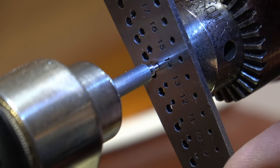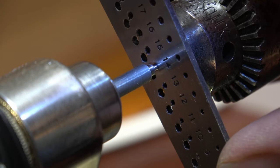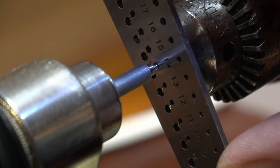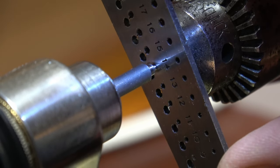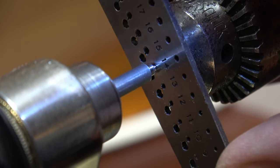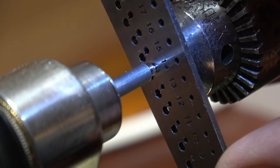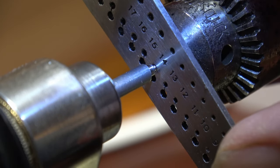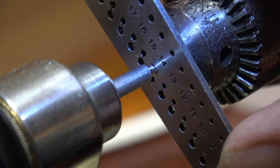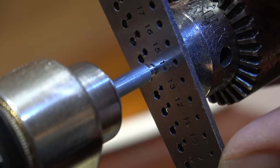Now literally you can't do too many turns without going the other way and clearing out the channels - ask me how I know. If you look closely at number 9 you'll see I actually snapped a previous effort off in there. So just gently, gently - a couple of turns in, a couple of turns out, until you work your way right up the shaft.